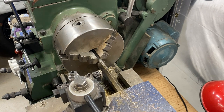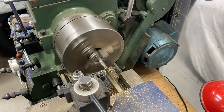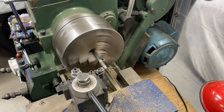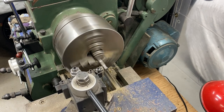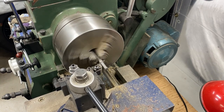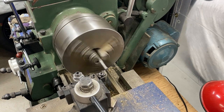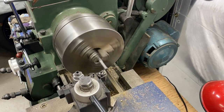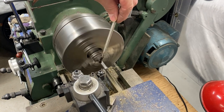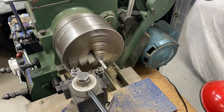I'm going to put a little lubrication on here so we don't chew up the bit, then engage the lead screw. When I turn it on and flip the lever it will feed itself. On a bigger machine you could do this in one pass. I'm keeping an eye on where I want to stop and when I get to the end I just disengage, drag it back, dial in 20 more thousandths, engage it again. That's looking better — there's a little shadow of a thread there but I'm okay with that, it's going to work fine.